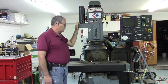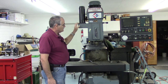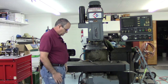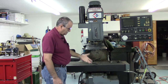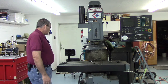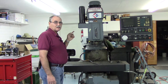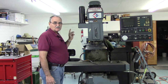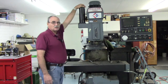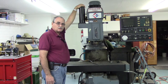That would allow for rigid tapping on this machine and monitoring the exact spindle speed. It's got five inches of Z travel. I'm not a hundred percent sure on the X and Y travels yet. It's a typical knee mill — a very well built machine. It's got a three horsepower spindle motor, which is pretty typical. This one has a pneumatic spindle brake, though I will probably not use that since I'm using the VFD with a braking resistor.